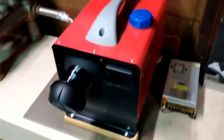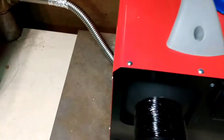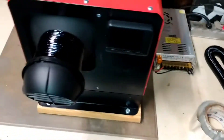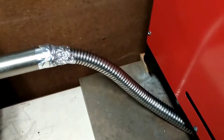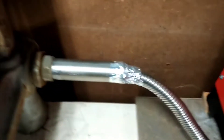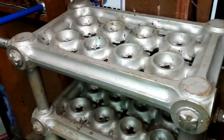Back again — got her all hooked up now for the first trial run anyway. See how good she is. I got her attached under there — that's the exhaust. I didn't hook up the intake; it came with the intake muffler, but I'm not worried about the sound, it's just going to pull air from in here. The combustion air goes out through this big heavy beast — about 200 pounds of cast iron — comes through my little homemade stuff there. Just had to do a little machining on these pipes to get them all airtight. I've got copper pipe inside of here. I've got a gasket — it's not sealed at all there, that might leak; that's the only spot I can see that might leak.